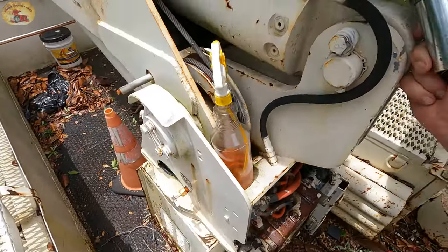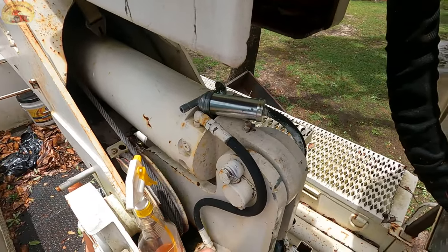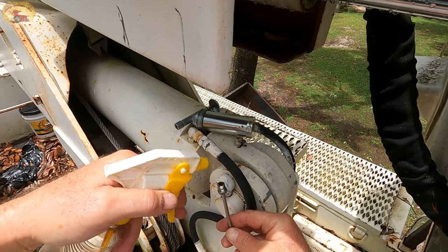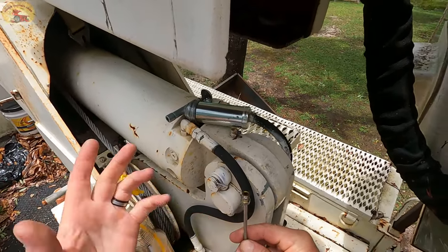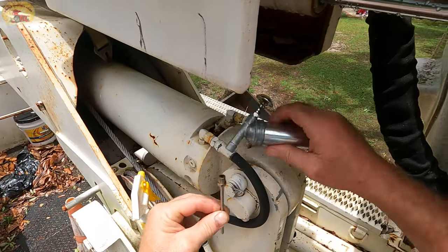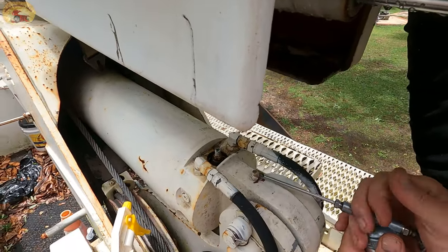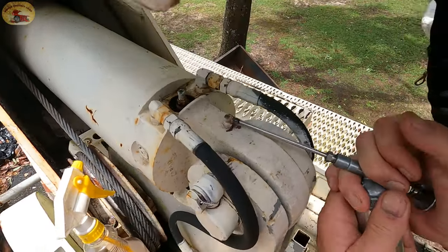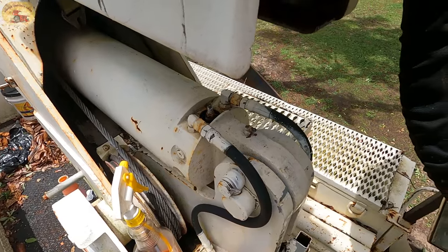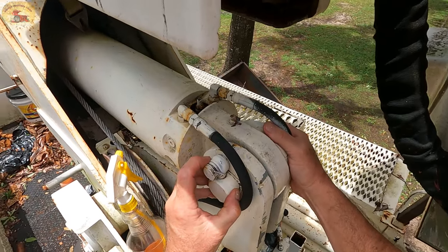This thing does the best job we've ever seen. Take out the small tip and before you screw it on, you take your blaster and you put just a little bit in the top of that hole. You can clean your tube out if it has grease in it already, but I like to leave a little bit in there so it doesn't leak out of the bottom. Screw that back on, put it up there and give it a good greasing — you're pushing it, see it coming out? You're pushing the blaster right down inside to where it's in the channels, greasing up this whole pin that's in this arm cylinder. That's how simple that is.